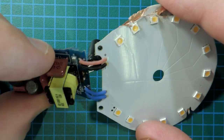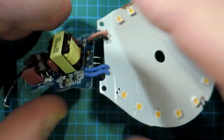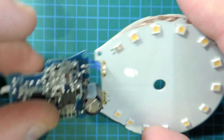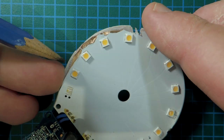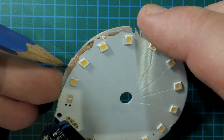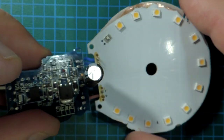Here's the assembly taken out of the plastic enclosure, which looks like it was sonically welded together. There's a circuit board here and the AC-DC converter. I've ground away a little bit of the circuit board because I was unsure whether it was an aluminum-based substrate — and it isn't. It's actually a fiberglass one. You can see there's a layer of fiberglass and then the copper — a fairly heavy weight for the actual circuit board material.